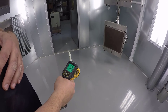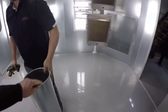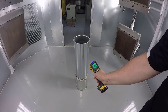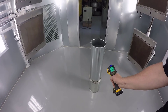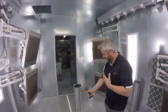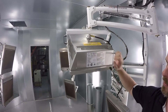The reason the floor is heating up is because it's a painted surface coated with organic content. If I put this bare metal pipe in front of the lamp, you'll see that it's going to stay cool — the only thing warming it is the ambient temperature of the room from the floor. And because I'm made of organic content, I can feel the heat standing here. Each one of these is an HD100, and two of them comprise an HD200.